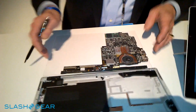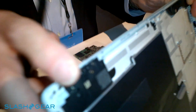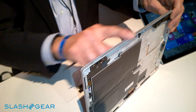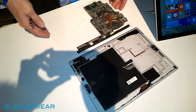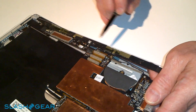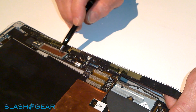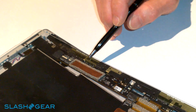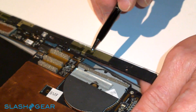On the top side of the board, toward the top, we have what we call the antenna window — it's made of plastic. That's where the RF energy comes out. As you can see on the top side, there are two antennas for the 2x2 MIMO. Under this area is the circuitry for the radio, close to the transmit-receive antenna — dual-band, 5 gigahertz and 2.4 gigahertz. This second antenna does receive only.